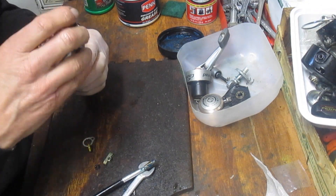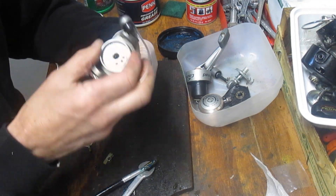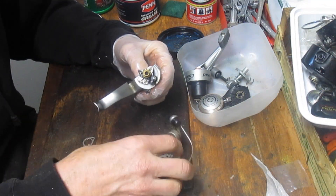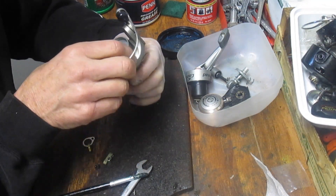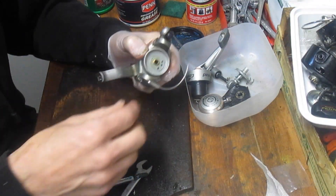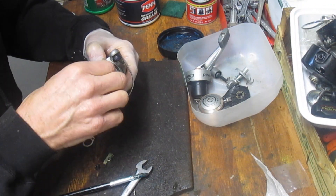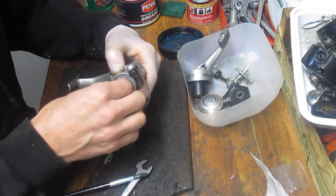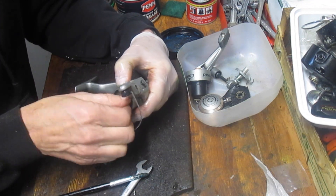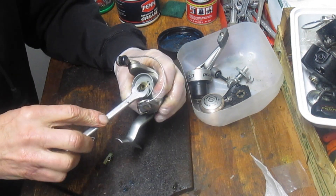We simply want to line up the flat side. There are two washers that were underneath here that belong on that. What I was successfully able to do here was to take the axle shaft off that has the hold pin without removing the rolled pin - that just makes life a little bit easier. If you wanted to you could have pulled the pin, but in the case of a servicing where nothing requires it, it's easier to leave it.